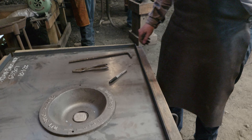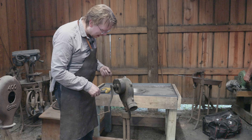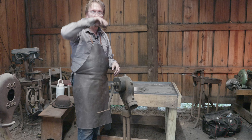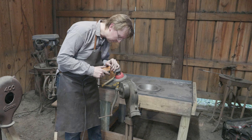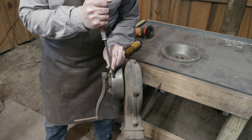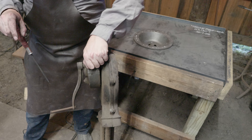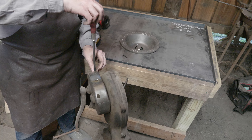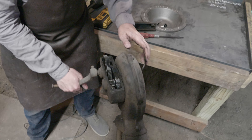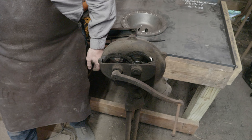Clinker breaker is installed and working. We've got a blower — it sounds like it's a little loud, a little knocky. It may just be that we've got no oil in there. Let me grab a wire wheel, clean this off a little bit, open it up, and see if it's got oil in it. If it doesn't, we'll put some oil in it and see if it runs a little smoother. This one is nice — it's got a little oil inserter. It looks like it is pretty well empty, so let's grab some oil and dump it in there.